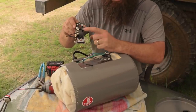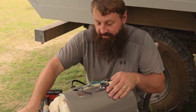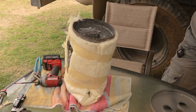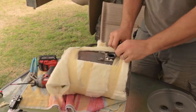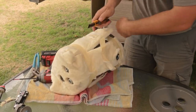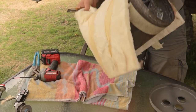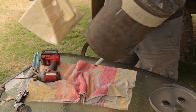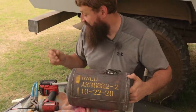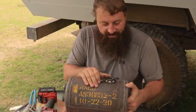That's the breaker — built-in breaker — and the thermostat with selectable between 66 and 32 Celsius. It just interrupts the circuit. Inside there's a little bit of rock wool and masking tape — they've just folded it over and jammed it in. Looks like a World War Two bomb. Coincidentally, that's part of the reason I didn't like our shower keg apparatus — it looked like some janky homemade thing, and going through a military checkpoint I'm sure I would get some raised eyebrows with that.